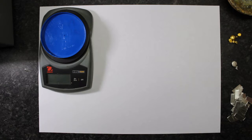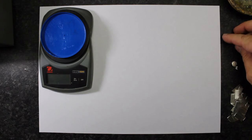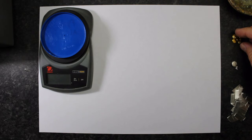I'm going to show you how to alloy white gold. There are a few things to remember when you want to alloy metals in general, but white gold in particular. There are two main types of white gold in the industry: one contains nickel, and the other contains mainly palladium as the ingredient that gives the gold its white color.